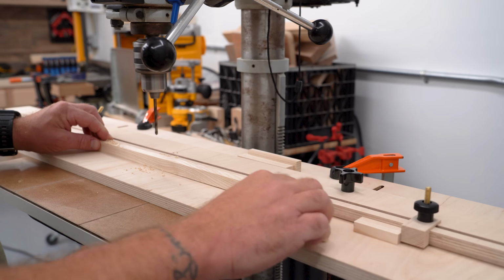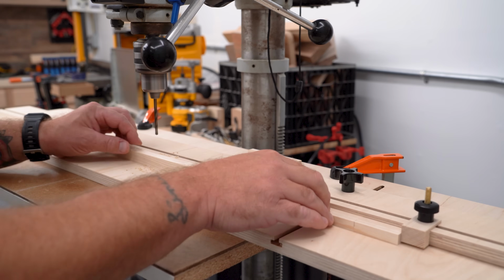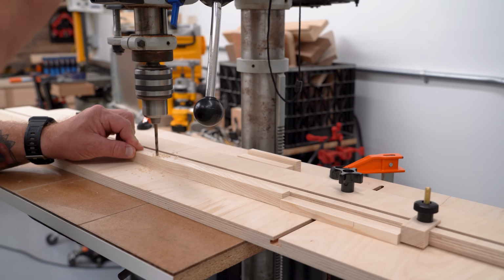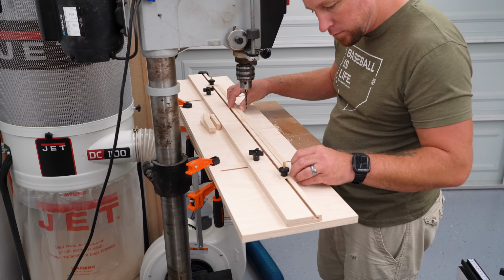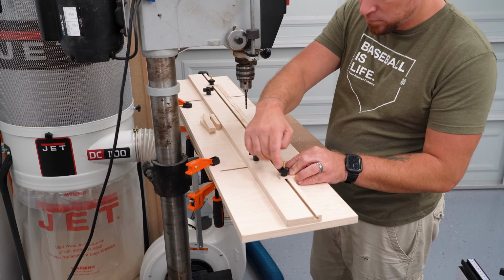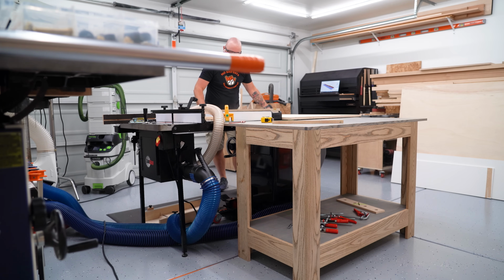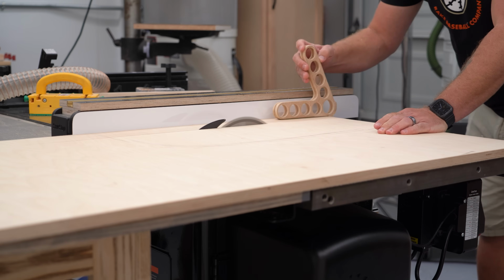After a whole lot of careful consideration, I came up with this design. It has an adjustable fence that moves forwards and backwards for different width materials, and an adjustable stop block at each end to adjust to different lengths. Now, because I like paying $6.25 a square foot for my plywood just to use it for jigs, I'm using 18 mil Baltic birch plywood.